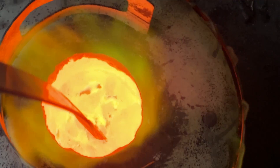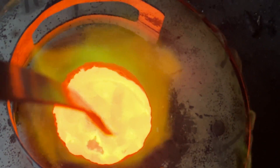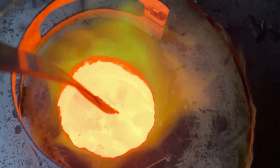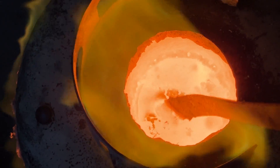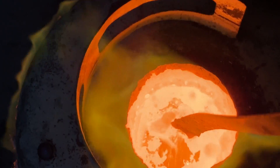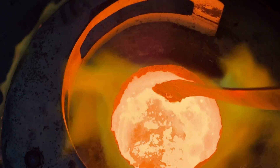You can see the chunks are still floating on top — they get red hot, and it's like glowing gravel floating on top of the copper. Eventually they disappear, and I can scrape off the dross, just like I would any other melt. Slag is specific to the iron industry, I believe — you could correct me if I'm wrong on that.